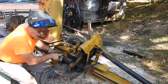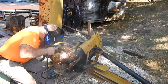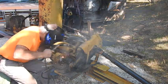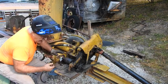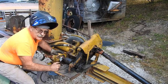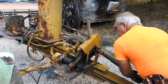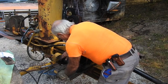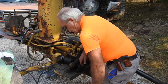I'm going to go ahead and touch it one more time — I've got to blow that water out of there though. We may get lucky. The title of this video should be 'what not to do to repair a hydraulic connector.' I'm just going to rotate this around to the other set screw — don't have to worry about the backlash now. I'm going to remove this set screw right here, make sure this is still cool. We're going to drill that hole bigger just like we did the other side, and duplicate the effort right over here.